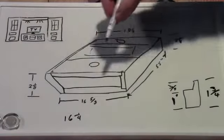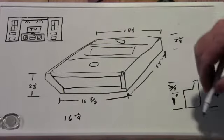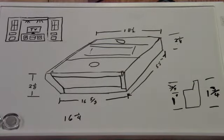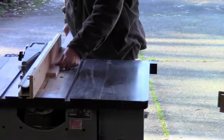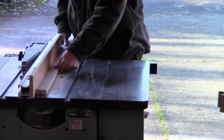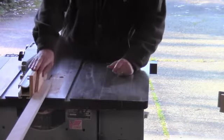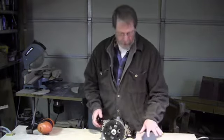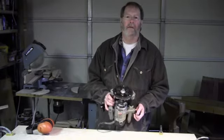We're going to start working on the bottom piece and the back piece now. I'm going to go ahead and make these rabbets that will appear in the back here to receive the top, and for the back to be received into the bottom. We're ready to make the final cut to complete the rabbet in the bottom on the inside. I have a straight edge clamped to my work piece, and I have a 5/8 collar with a half-inch straight cutting bit.